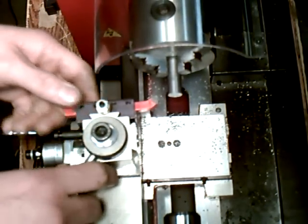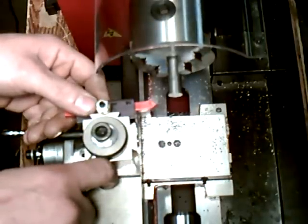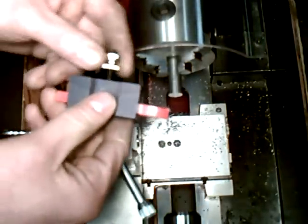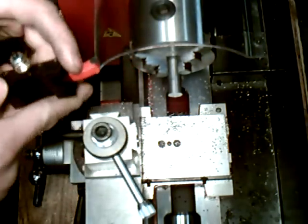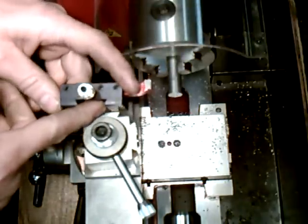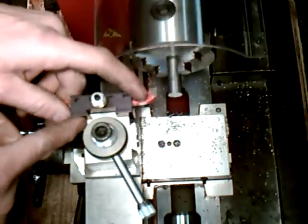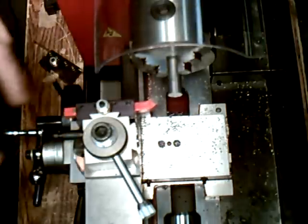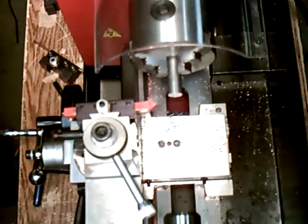put it in there. Now with this one, to get the center line, basically just make a few cuts and you're adjusting the height with this knob here, and once you get it in place, it's pretty good. As your bit wears out, you may have to adjust it or just change your bit, but you can always adjust it, as opposed to the other one. You got to stack some shims underneath it, and it's always hard to get the exact height there. So like I said, when your budget allows, you should definitely look into getting one of those.